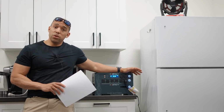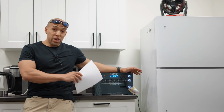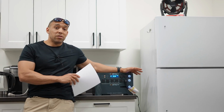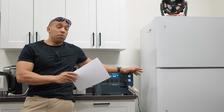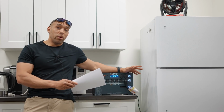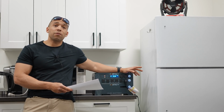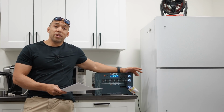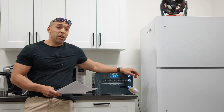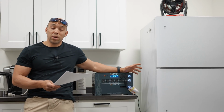This one is 1500 watts, so you can crank it all the way until the battery or the batteries run out, if you have many other batteries underneath, because remember this is modular, you can add up to 96 batteries. You can run that sucker until the wheels fall off. But bear in mind, in doing that rapid discharge of any battery, it is going to have implications for the battery's longevity. So it might mean the difference between 500 recharge cycles to 80% of its stated capacity to 2,000 cycles. Ideally Inergy suggests not doing that, obviously, which is why they capped the last one at 650.